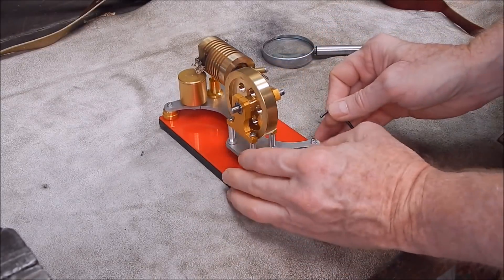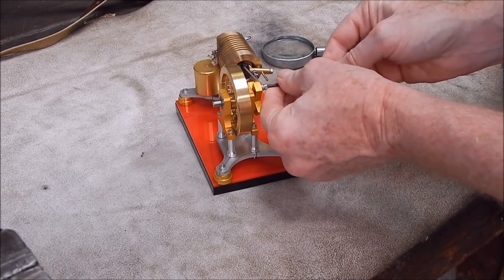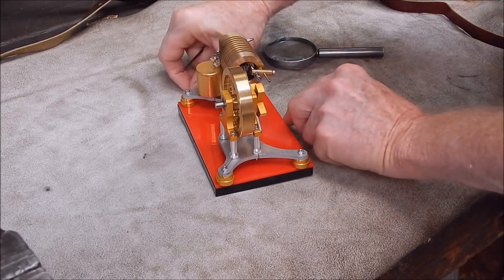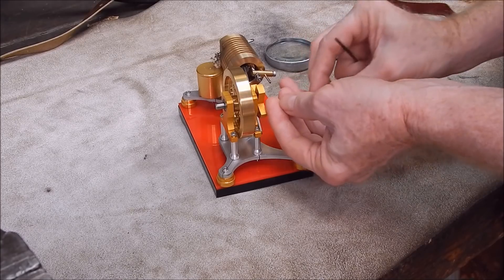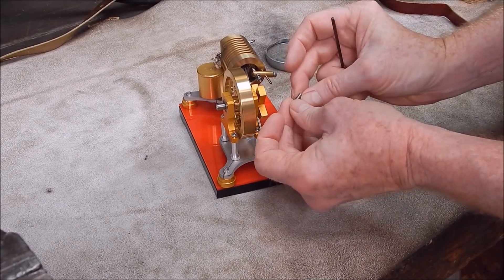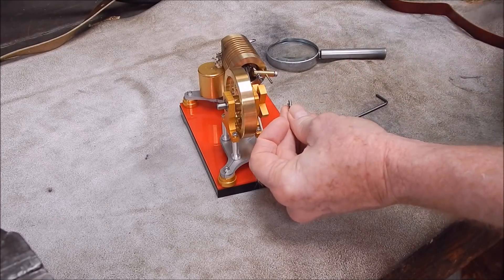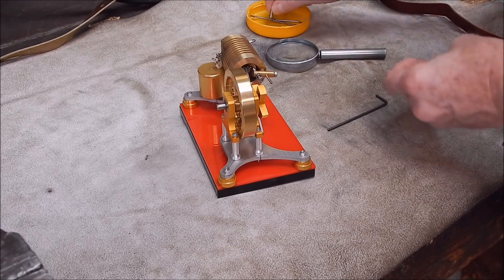The first thing is to disconnect the crank pin. These are all 3mm Allen-headed bolts, which is really good. Oh, there's a little washer there — that made a bit of a getaway. It's got a little floating sleeve on it — it's a normal bolt with just a little sleeve so the thread doesn't chew out the end of the crank conrod. We'll put these bits in our Vegemite lid.